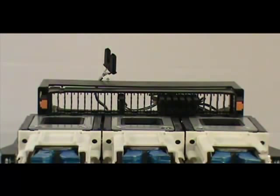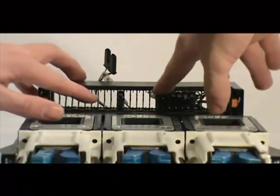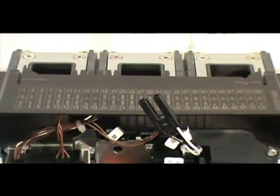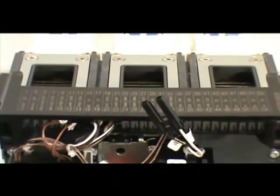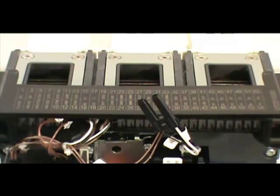The last step is to connect the secondary leads. To simplify the process, release the secondary tray by pressing on the two orange tabs on the back of the tray. Slide the tray until the back edge of the tray lines up with the numbers. The spring release's leads should connect to positions 35 and 36 in the secondary mounting bracket.